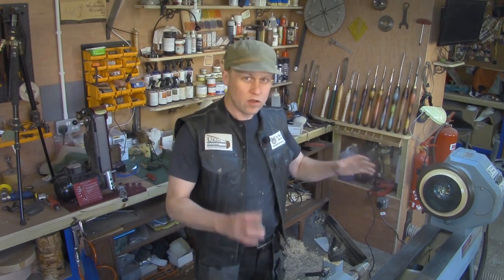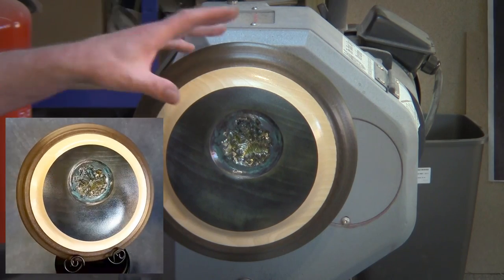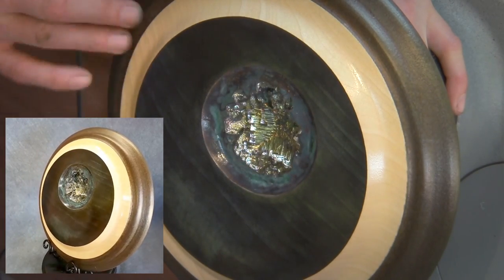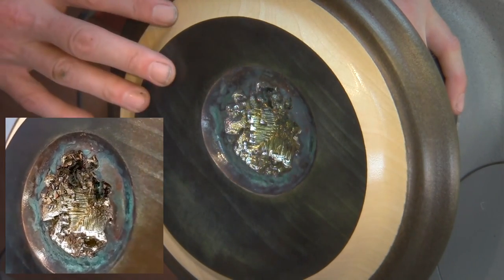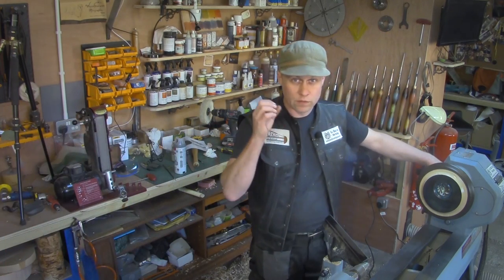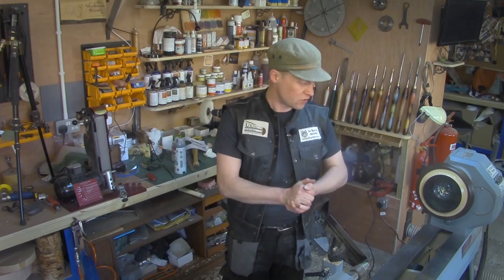Well, there we are. The battle, I think, is won. I was really worried as to whether or not I could pull this piece off, and I think I have. It's turned out really nicely. It's much nicer in its proportions than it was beforehand. But I finished it off by sanding the natural wood bit here, and finishing the whole lot with Hampshire Sheen over a satin sealer, and just the boss area here. The metalwork area has been sealed and had a little bit of a gloss lacquer applied to protect the oxidization there. So overall, I'm pretty happy with how it's turned out, to be honest.